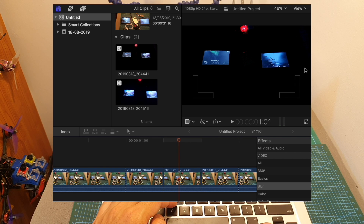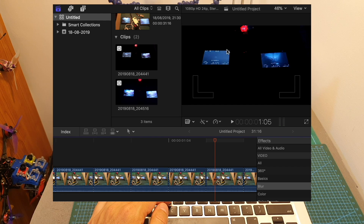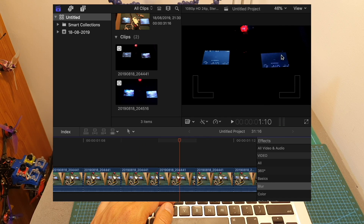At this point you can see that the room is completely dark, however we can still see the light on the screen because of the latency. Just as a reminder, this is the HDMI screen and this one is connected to the AV out. After five frames this screen is completely dark, which means that the latency of the AV out is about 20 milliseconds.